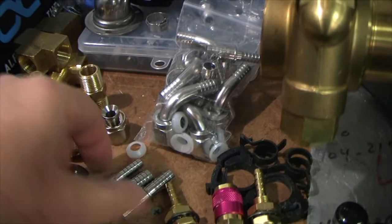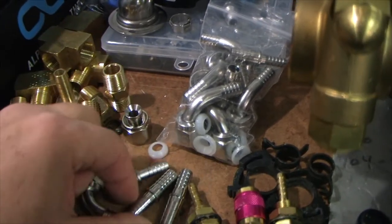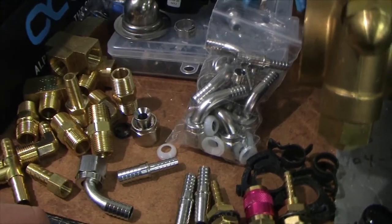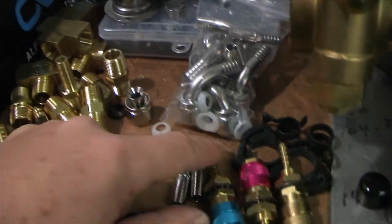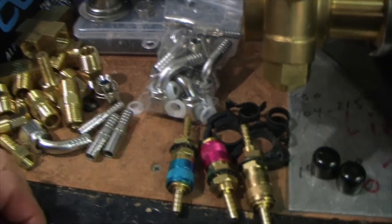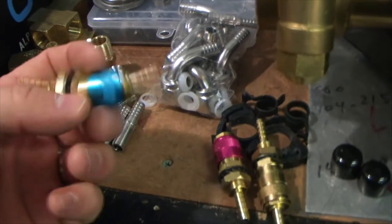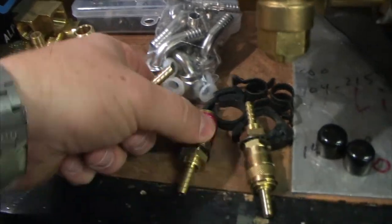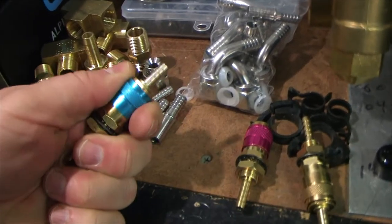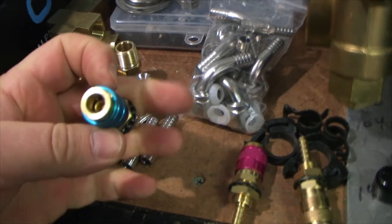The soda supply fittings recommend these little nylon inserts that go inside the fitting and allow a really nice seal without leakage. A few other bits: reducers — 3/8 to 1/8, 3/8 to 5/16 — just useful to have. I also found some quick-release fittings on eBay — standard made-in-China parts, quality seems fair. They're somewhat odd but are quick release. Make sure whatever you get is stainless or brass since you'll be running water and coolant.